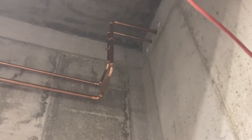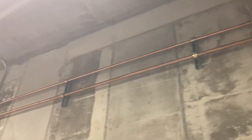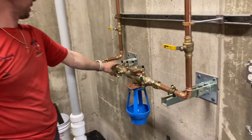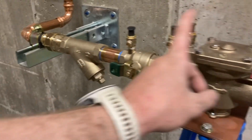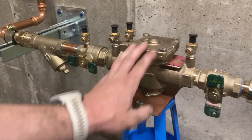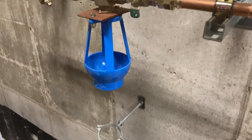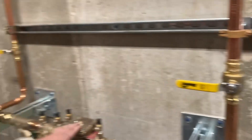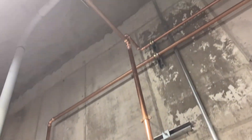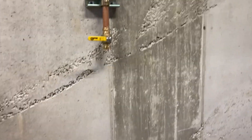We come through, forward, down, over here, and our Y-strainer. We're going to put a little half-inch ball valve there next time to blow this out and clean it. Backflow preventer — testable — with our air gap, valves on each side so they can be worked on or removed. Up forward with the clevis hangers, and down for the mist machine.